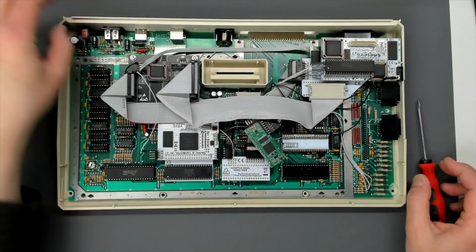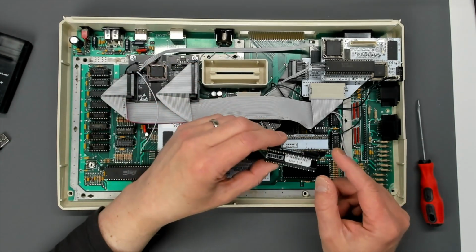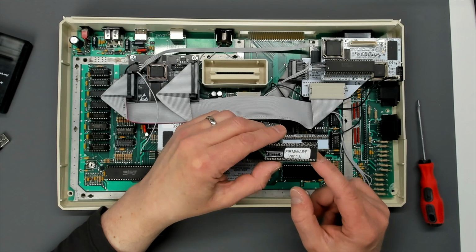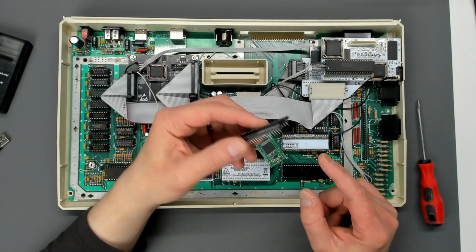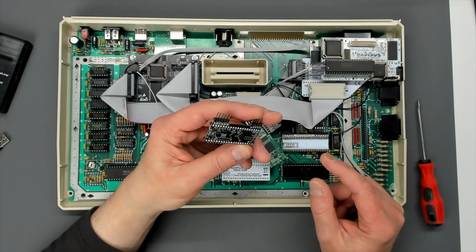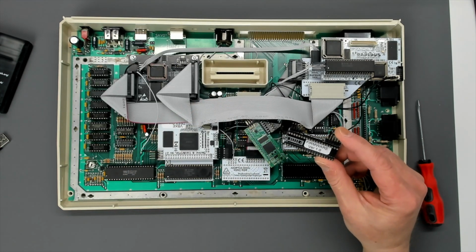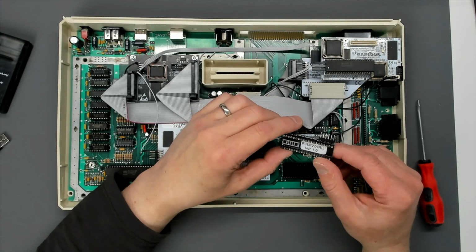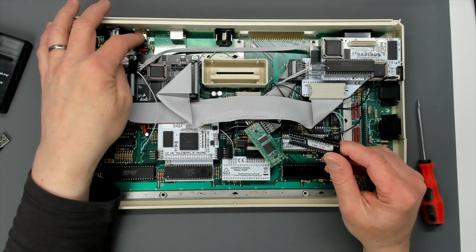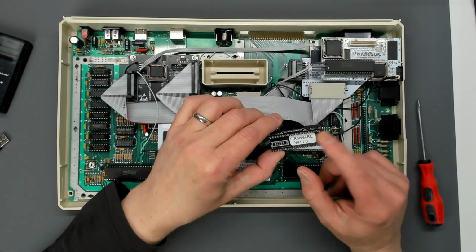So initially what I had to do, of course, was put this board in the machine, flash the new firmware, and verify that it worked. And this will be a full featured version because it has more RAM on the flash chip. Flash RAM doesn't seem to make much sense, but the flash chip has integral RAM, and this has got more of it, which apparently the full featured firmware needs. So this can do some pretty interesting stuff, which I haven't been able to test yet. It might be nice to test it in a video, such as booting from a USB stick. If you forego the keyboard functionality, because there's only one USB header on the board, apparently you can boot the machine from a USB stick with the full firmware.